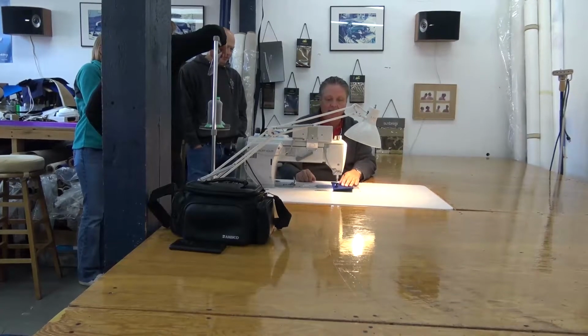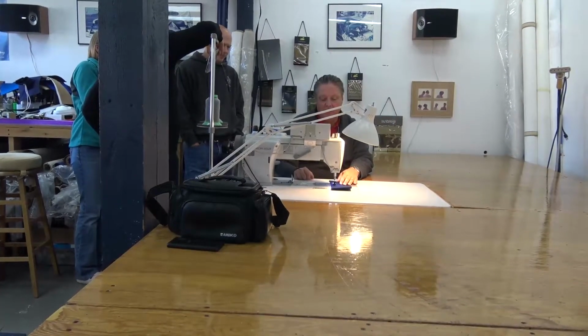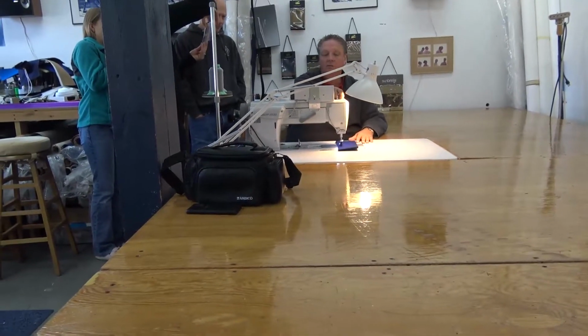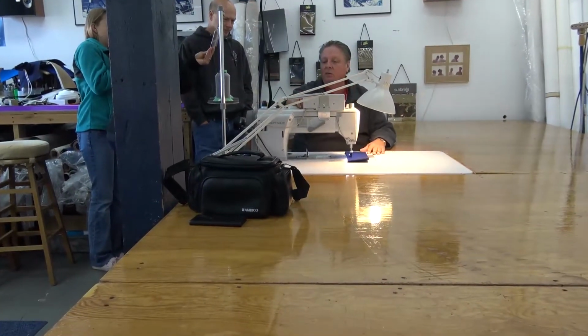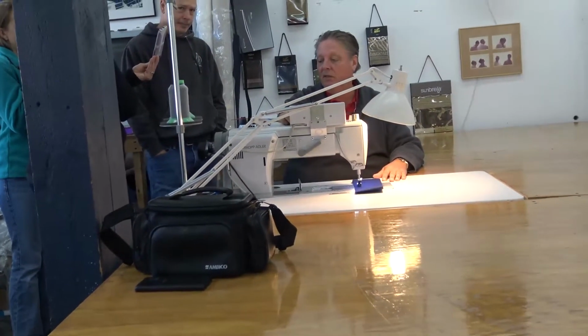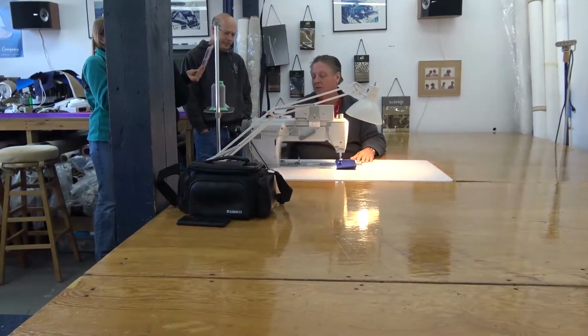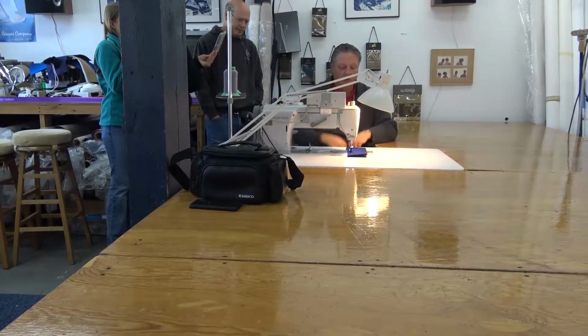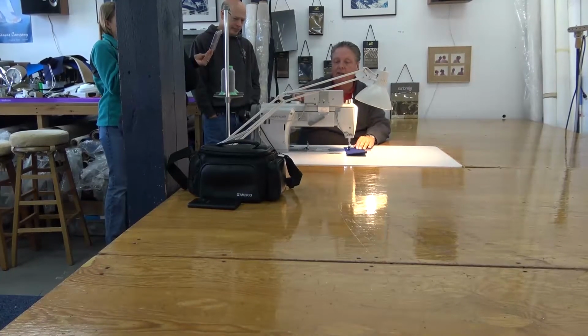And these little lights, they're really nice. And so you got some basic adjustments. You got thread tension, you got foot pressure, which is here, and you got your walking height adjustment, which is here. And those are your three main adjustments on the machine, and your stitch length, of course. So you got four. Anyway, that's how that goes.